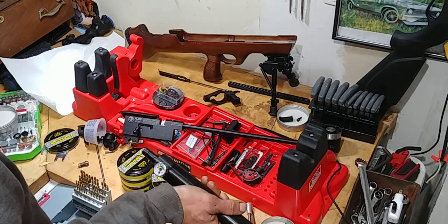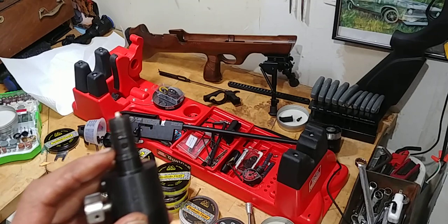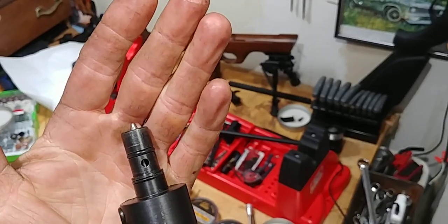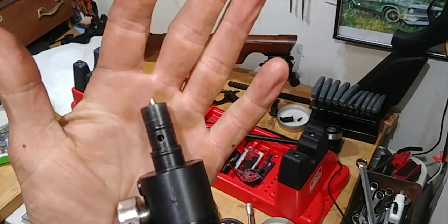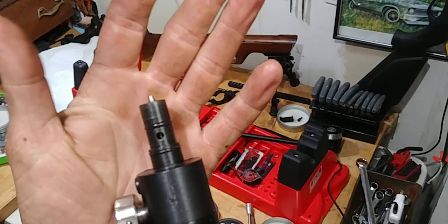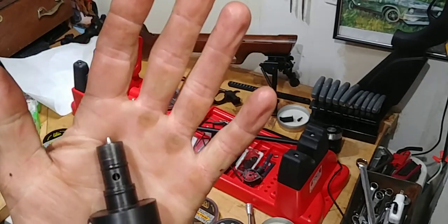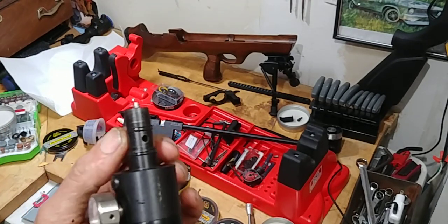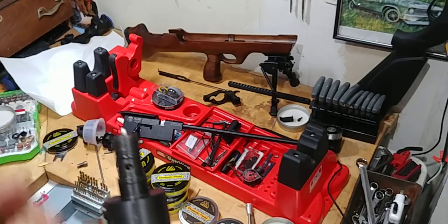And the air tube, I said, was 150 thousandths. This is not a problem. I will have no issues enlarging that to 160. Actually, I think I'm going to do 180, 185. I really want the air to come out of here, so that's just going to be one less restriction, and there will be no harm or foul with opening this up. You can see the O-rings are really far apart.